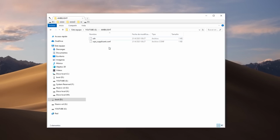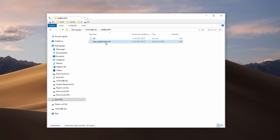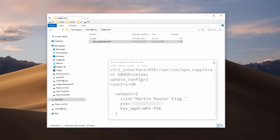Now we are going to make it have internet. In the description, I leave a link that contains 2 files, one called SSH and another called wpa_supplicant.conf. We drag this last one to a notepad, and we will change where it says SSID and PSK. Within the quotes, we enter the name of our Wi-Fi network and the password below, in that order. Then we save it, and that's it.